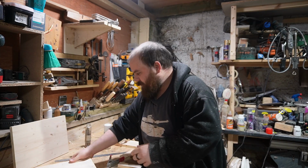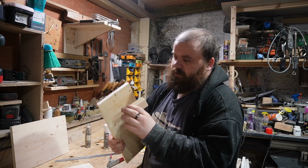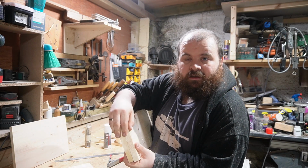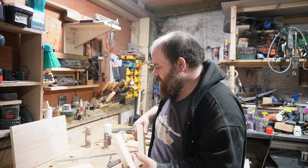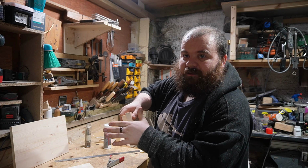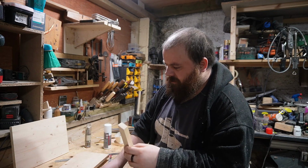The very last thing we need then for assembly is these two little blocks. So what these blocks do is they go here inside and increase the width here at the top, which adds a bit more security, to use English correctly, because that wider area means that our screw is going to pull in and our top can rack less.